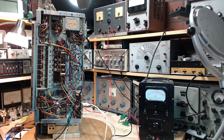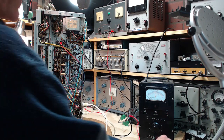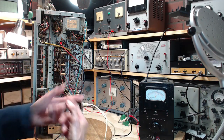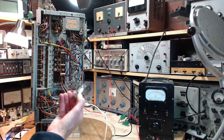That's how radios work. So on the output of the mixer tube, this tube has different names in different parts of the world, this function of that tube, but here we'd like to call it a mixer tube because it's mixing the antenna and the local oscillator together. Some people call this a frequency shifting tube.